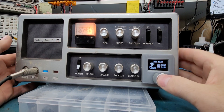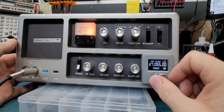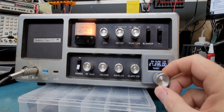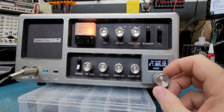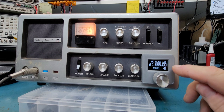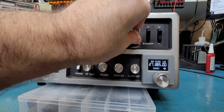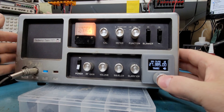You can go into VFO mode, and this is why I always say you could use channel mode for channels 1 through 40 and then use this as your VFO as your main running-around channel. The clarifier won't work in VFO mode because you can go down to tens of hertz here, which is what the clarifier does — so instead of making them both run slow down there, we've set it up that way. It works really well, goes through the different modes — upper sideband, lower sideband, and AM.